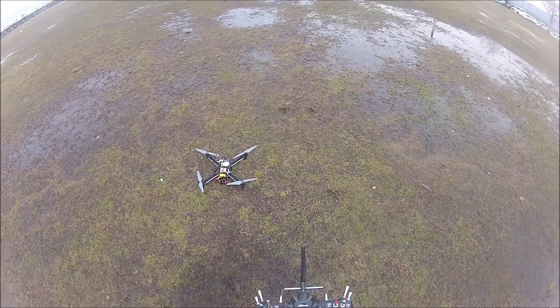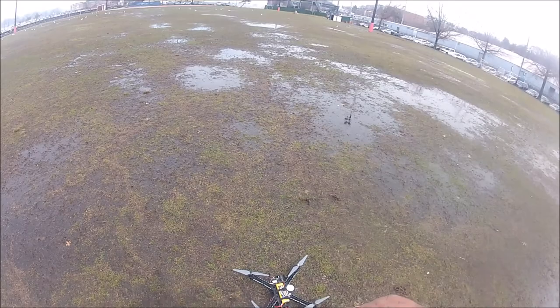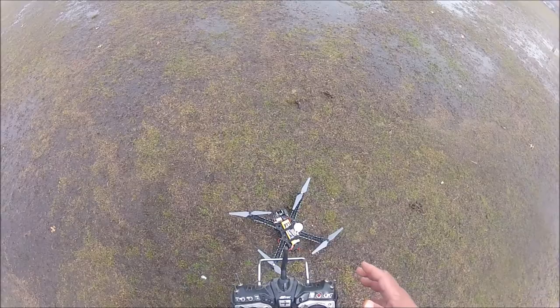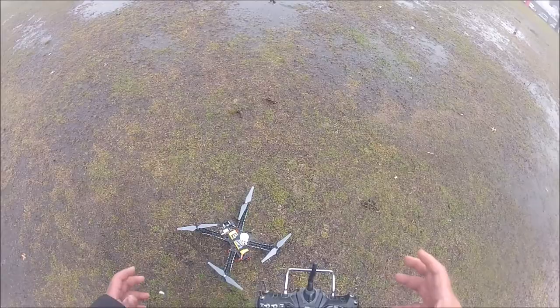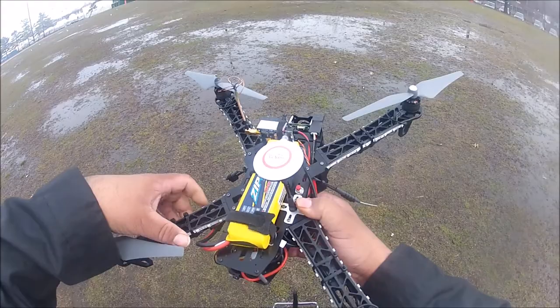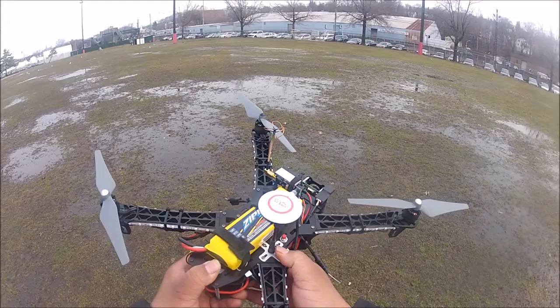The video transmitter has the capability to take me even further, but I just want to use that 1000mW transmitter to get good signal penetration without needing crazy FPV frequencies that force you to shield everything on the aircraft to prevent interference — like 1.2GHz or 900MHz. I like my 5.8GHz setup.